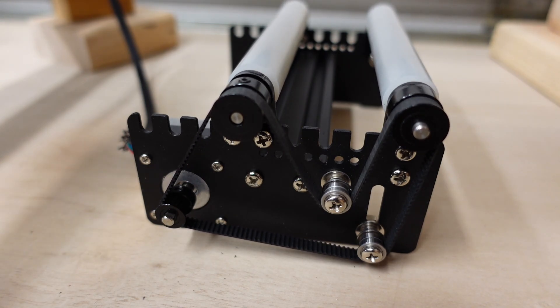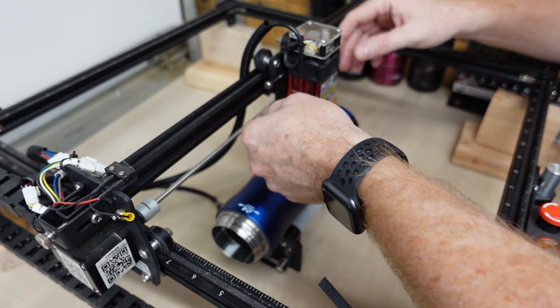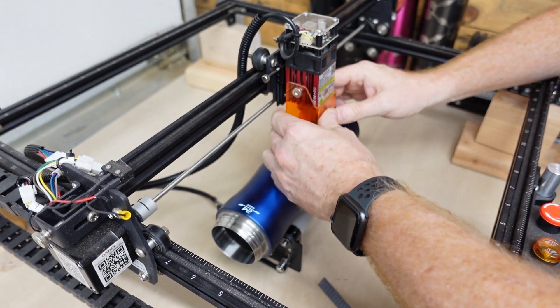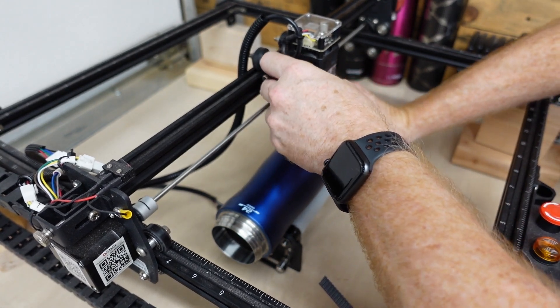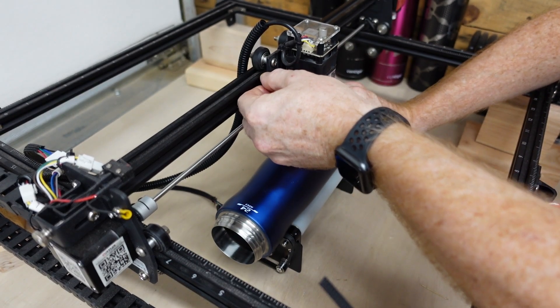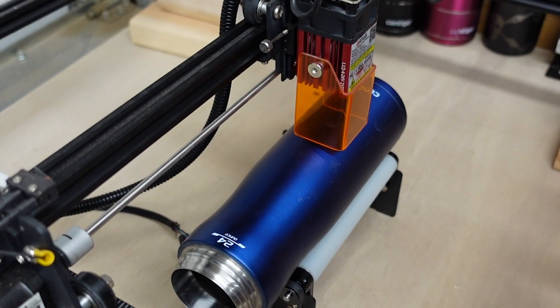It's trying to home across the Y axis. So we're going to position this in here underneath our laser and undo these guys a little bit. Lift this up, put our focusing billet in here. I think that's good, might be a little off. And then I want to fire the laser because I want to start in the middle of it if at all possible.